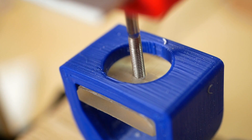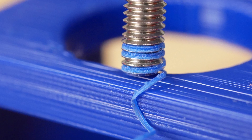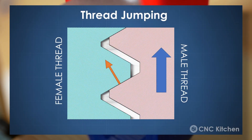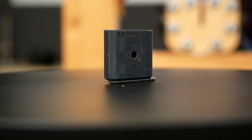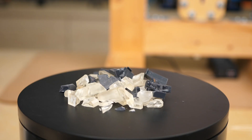Threads usually fail in two different ways with one additional special case. Thread shear is where either the male or female threads simply get sheared off and often remain on the bolt like a coil — this usually happens when one of the threads is made from a significantly weaker material like plastic or aluminum. Then there's thread jumping: since the threads are at an angle, you get a radial force component that will stretch the hole and at some point the threads simply jump one thread over without a ton of damage. This can happen if the material in which the female thread is located is soft or has very small wall thickness. Finally, the last special case is total destruction — when the radial, axial, and hoop forces are strong enough to completely destroy the part, which — spoiler — we'll see quite a bit on the resin prints.